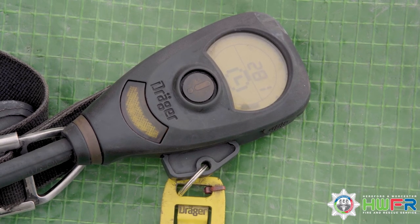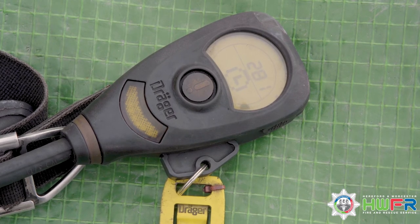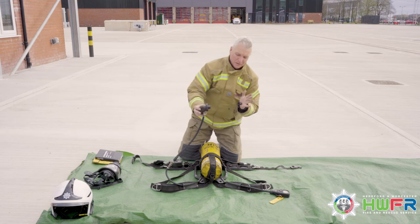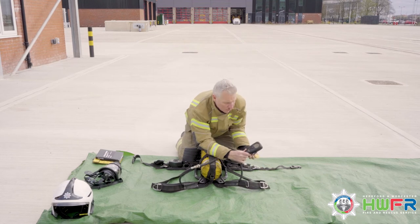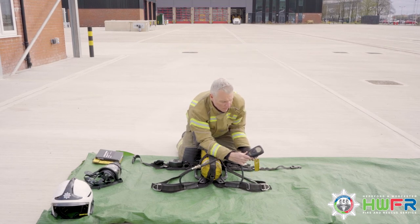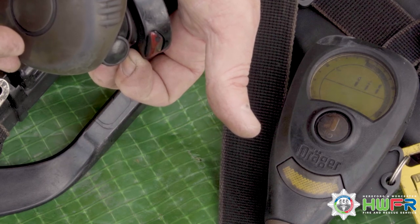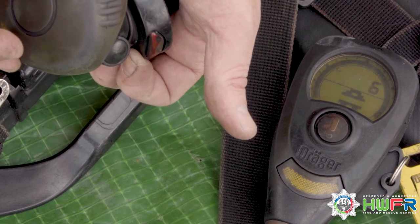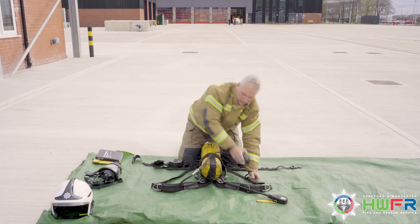The set is now counting down and the bodyguard will display if the leak test has passed — indicated by a checkered arrow with an open valve. Place the LDV over your hand, press the supplementary air supply, and observe the bodyguard. Gently release the air through your hand, observing that the low-pressure air whistle will activate between 80 and 70 bar, both audibly and visibly on the bodyguard.